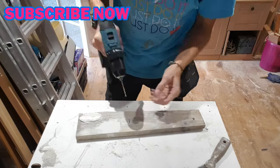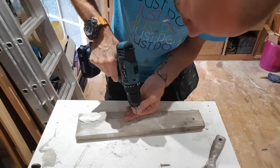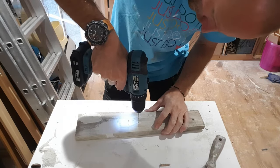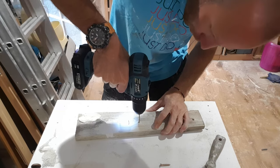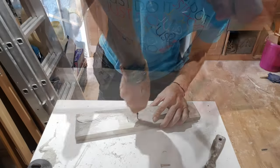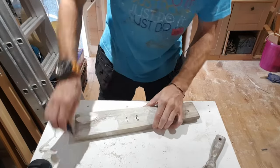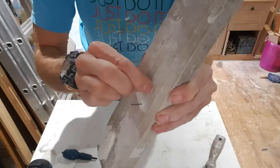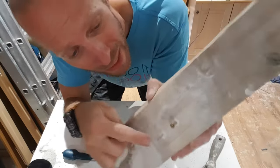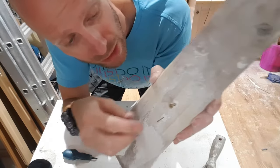For this other bit of filler I'm going to use a 3.5mm drill to pilot for this number four screw. I'm hoping it's not going to be too big. Well, you can definitely drill it. Wow, look at that — that is brilliant. I've got to be honest, I've never actually put a pin or a screw in this filler before, but I definitely will do in the future if I need to, because that is just really good — fantastic.